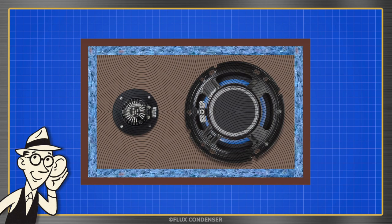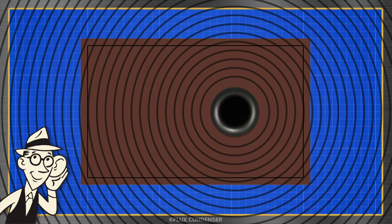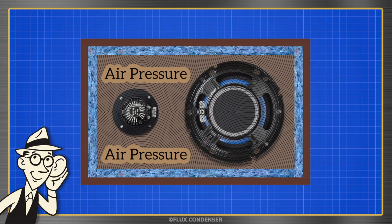You may wonder why the sound of a speaker's interior is important since we listen from the outside. Well, with ported speakers, you very much are hearing the interior of the speaker, and with sealed boxes, the interior dramatically affects the way the woofer cone moves.